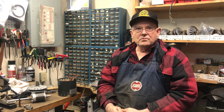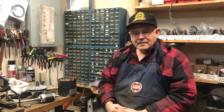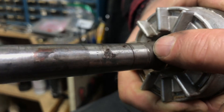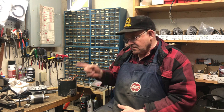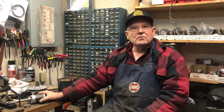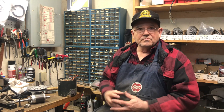My goal at Shopsmith Repair Woodworking Academy is to save you money, so anything running seven fifty to nine hundred dollars I have to look for another solution. When I was working on this machine, the motor bearings had locked up and the customer kept running it that way — but it didn't burn out the coil. You can see here the bearing just spins on the shaft. It wore down the shaft so much that even with shims I couldn't repair it. So I took a good coil from this machine and the armature from the other machine, and I was able to get one motor running A-OK. That saves the customer about four hundred dollars on this repair.